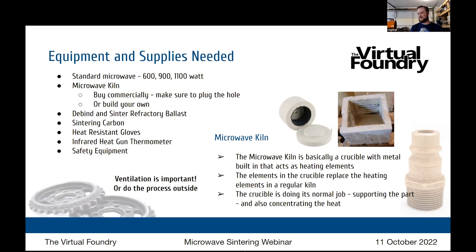Yeah, and to the degree of accuracy that I have for this is an infrared gun. What I'm doing is measuring what I can observe at the scale of my eyes and the strength of my hands and hammer. With the degree of the ramp rates, that's been just sort of meticulous measurements throughout areas of the kiln with the element by itself at various power levels. And just observations. So that's why we can't really publish the full process with guaranteed success yet.